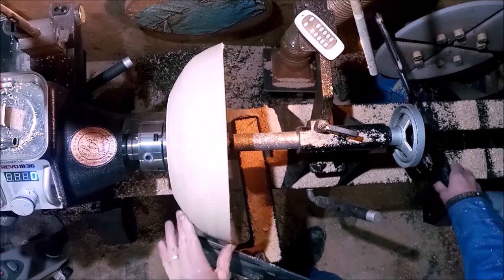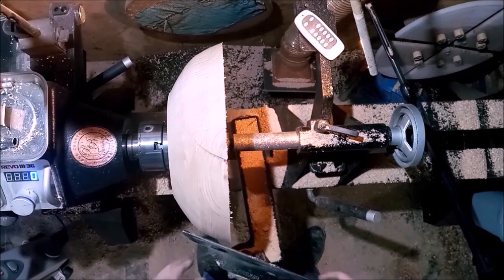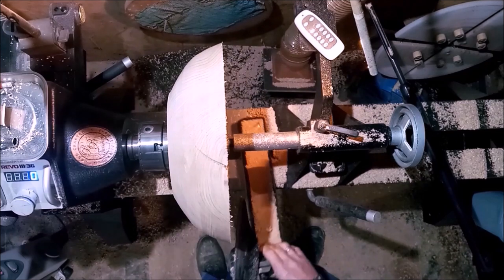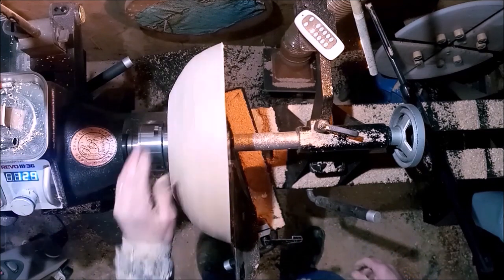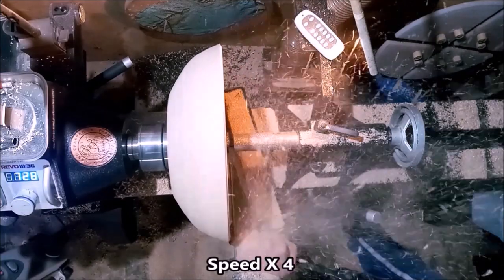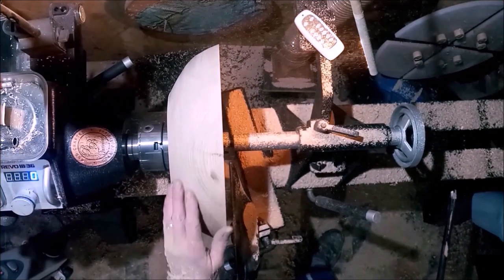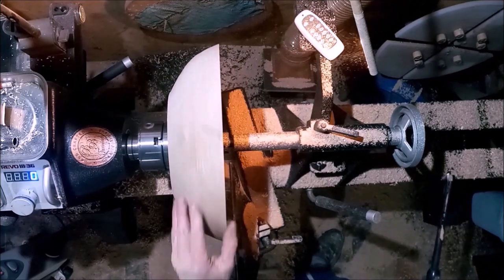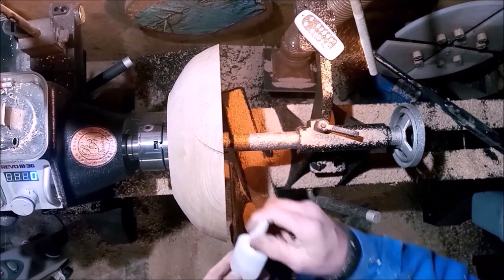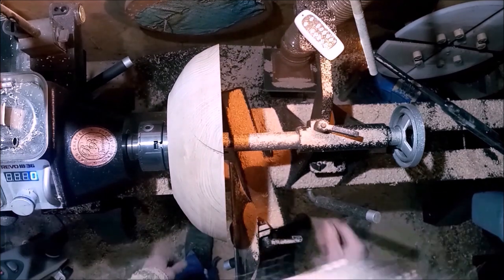Yes, it has. Right, okay, so we've two cracks. We've one on that side, we've one on that side. Right, now I'm going to take that down to get rid of that big chip that's out there. No sense in killing quality for size. Now I'm going to treat those cracks properly this time, but I'm going to heat that CA up a bit more. Right, so I'm going to treat those cracks and I'll be back in a minute.